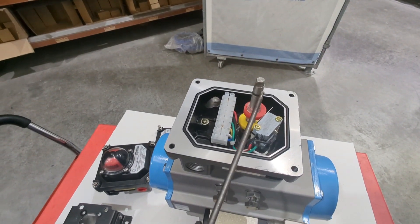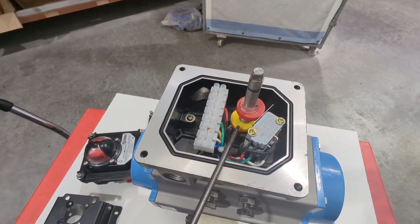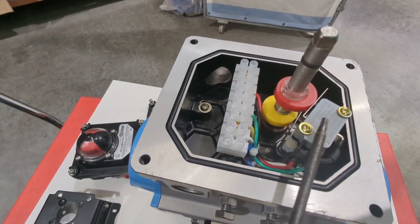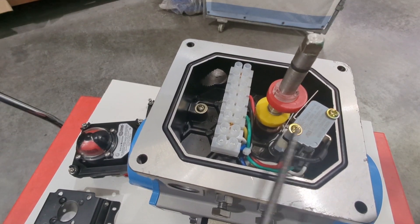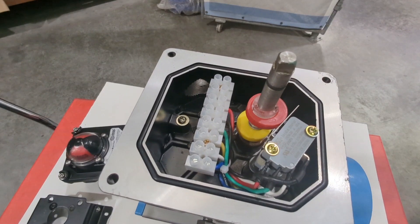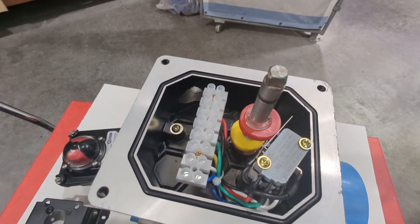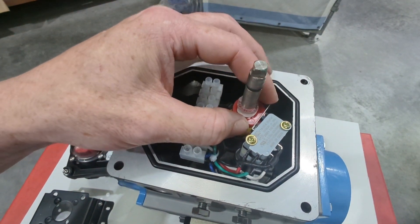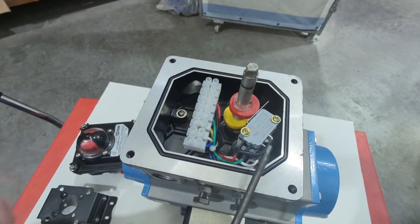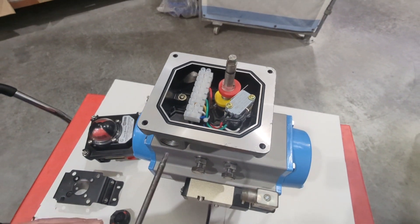Your shaft runs down and connects with the actuator — it's got two cams on it, the yellow at the bottom and the red at the top. As the shaft turns, these cams trigger the two switches, so usually you'd set it for open and closed — what we'd call end-of-position feedback. It won't give you a 4–20mA signal like a modulating positioner; it's only giving you two positions at a point in time. You can adjust these positions by pushing down and adjusting the cam. At the moment this top switch is depressed and the bottom one isn't — we'll actuate this in a minute so you can see what these do.